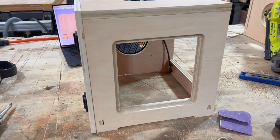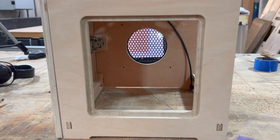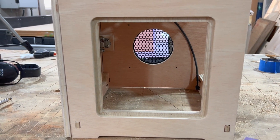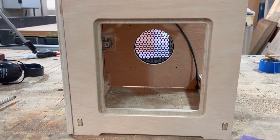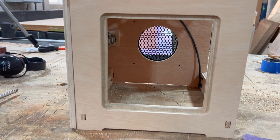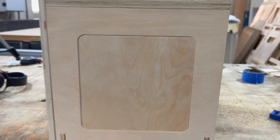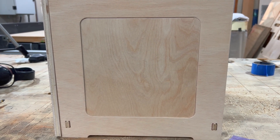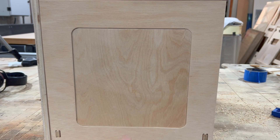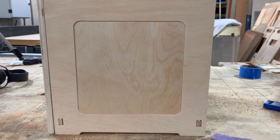These are the insets I carved into the side of cabinets to lighten them up. Basically you can take out a lot of volume of wood by going from a three-quarter inch side down to a one-quarter or one-eighth inch side. This inset uses a 0.005 offset for clearance and it fits really nicely, so I can just glue that right in.